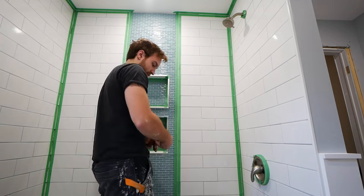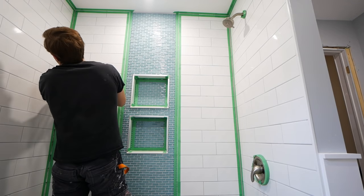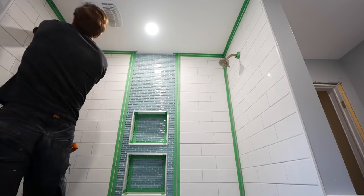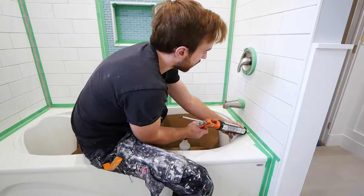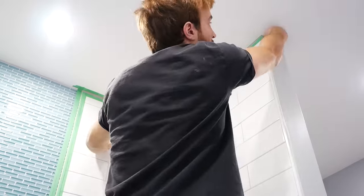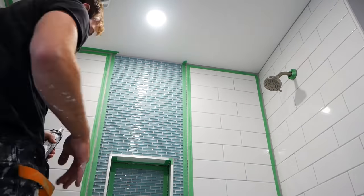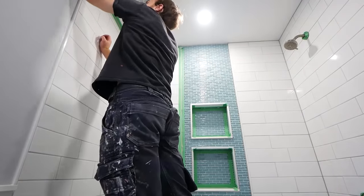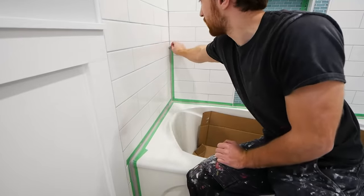When it comes to silicone, typically you can get a silicone that will actually match your grout color. However, they didn't have any stock so I went with the next closest one, and it turned out okay. I like to use painter's tape to get those nice crisp lines. I also applied some silicone to the separation between mosaic and subway tile, as I had some jagged cuts along the glass mosaic, and the silicone kind of hides that — something I can improve upon in the future.